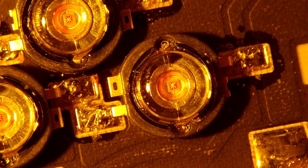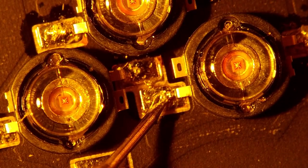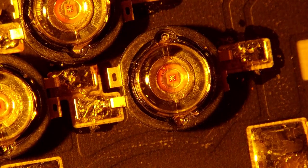Meter set into proper diode mode now. Let's get our leads set up. We're going to test the first one — and look at that, that LED lights up. Why that one lights up? Oh look, that one is lighting up too right here — you can just faintly see it. Let me turn this off and we'll get a better view. Look at that. So with that being said, it appears that this board's LEDs are potentially okay. We're going to test them all. It works.